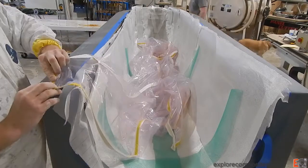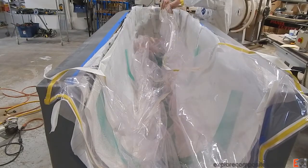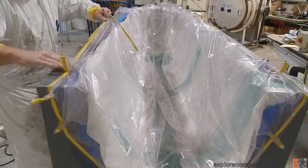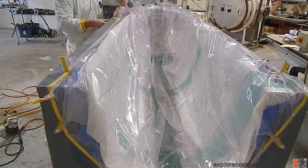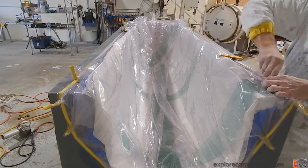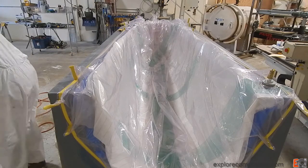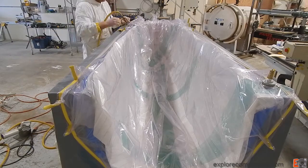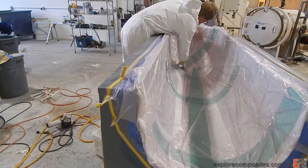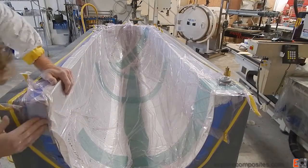Now I'm bringing the bag around. I'm glad I've already got the sealant tape on it — it's easy to lay everything out and I don't have to worry about making pleats in place. Just spread the bag out, tack the corners, and work my way along and down around the back end. I always try to keep the pleats symmetrical across the bag, especially on a symmetrical part like this. I put in the vacuum fittings — one on the front, one on the back — trying to make sure we get enough flow while keeping those fittings out of the way of any potential wet resin. A dry rotary vane pump probably pulls about 25 inches of mercury and it's pretty heavy duty when it moves a lot of air. This came down pretty quickly, and I'm working the tacky tape around to make sure I've got no leaks and hoping I get a little bit of resin bleeding into that.